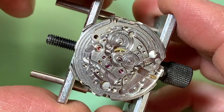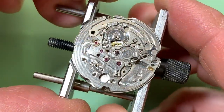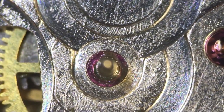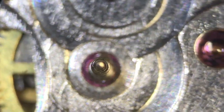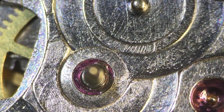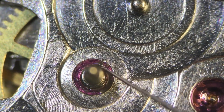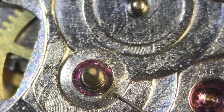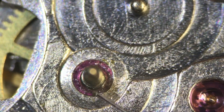Can't see anything obvious. I'll put this now on the scope and we'll have a look at the top of the main plate here to see if we can spot any dirt or anything obvious. Here we are on the microscope, looking at basically the fourth wheel staff pivot, along with the center wheel. All I can notice is an obvious bit of dried oil. This should be fluid — it's quite gelatinous, you know — it shouldn't be like that at all. So that's certainly going to be hindering things here.